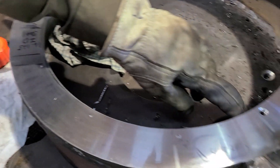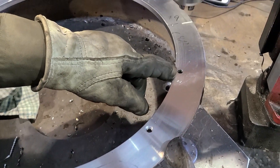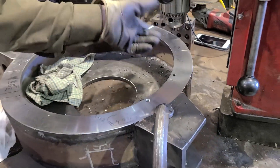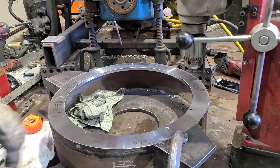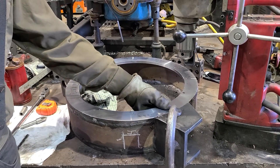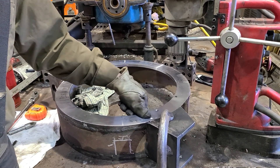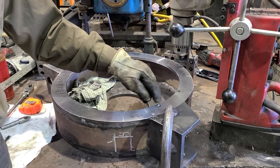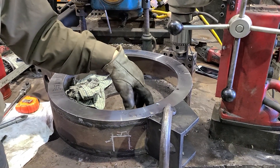I've already started on here. What we're doing is a 5/16 drill, then a 3/8-16 tap. Then come back with a deburring tool to deburr it a little bit and make it so the bolts fit in there nice and easy.